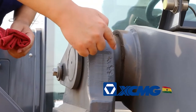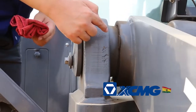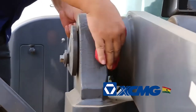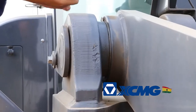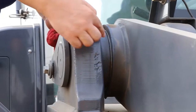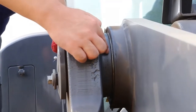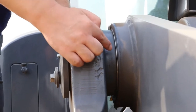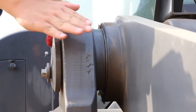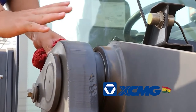For example, right here — we can see the old grease is there. So right now I'm going to clean it. After two days, anyone can come and check this point. If new grease has come out, that means the greasing is good. But if it's still the same — no new grease — then definitely something is wrong.